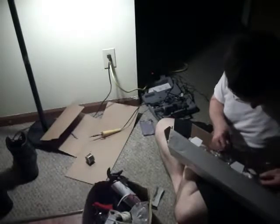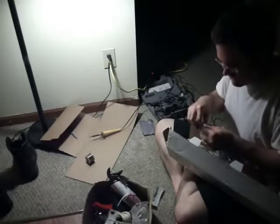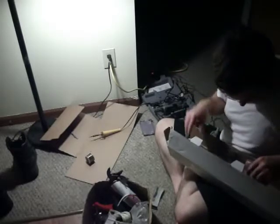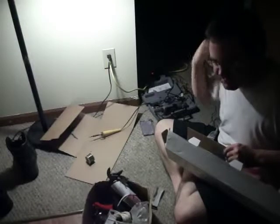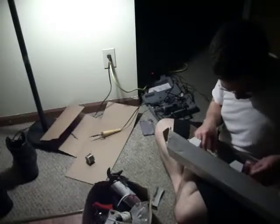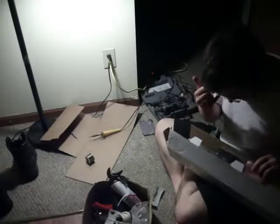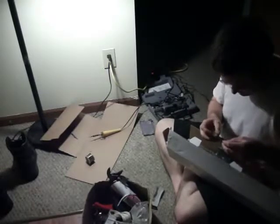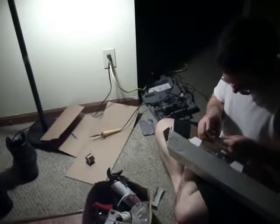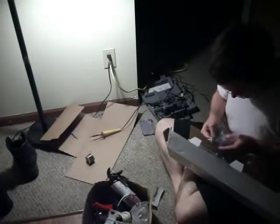Now I have to be careful which colors I put on the circuit because of voltages. The longer wavelength, which is the lower frequency, such as red, orange, and yellow, require around 2 volts of electricity. Now the shorter wavelength, the higher frequency, which is the cooler colors, such as blue, green, white, ultraviolet, they work comfortably around 3 volts, up to 3.5 volts or whatever. Now I got something else to show you that's pretty cool.